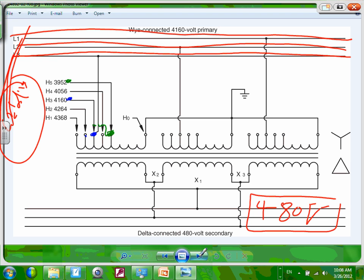So in the winter, a lot of utilities, in the summer we peak in Minnesota. In the summer, they come and they adjust this one to go exactly where it's shown here, because the transmission line will, in the summer, be overloaded. In the winter, if they keep it where it is right now, you're going to have high voltage. You're going to end up with 500 volts here. That's bad news too. High voltage, low voltage, bad news.